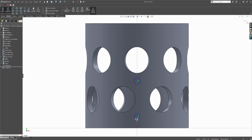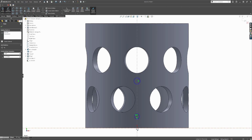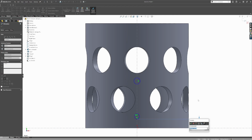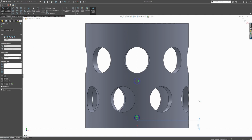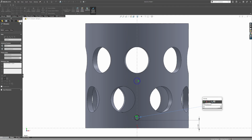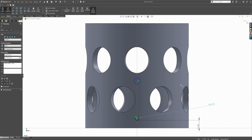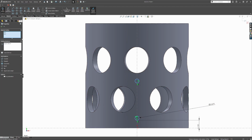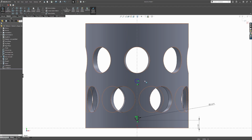We're going to smart dimension this 0.1 inches away from the base, because we know that our thickness on the very bottom is 0.1. So I'm going to do 0.11 or 0.15, just slightly above, and then I'm going to dimension this 2 millimeters. 2 millimeters because that's the size of the filament, and we want to oversize it to give it some clearance. Alright, and I'm just going to make these 2 and make them spaced apart.